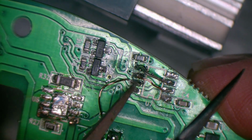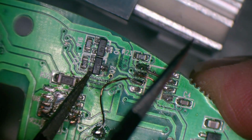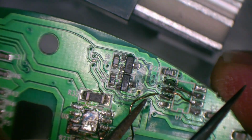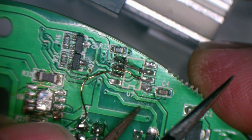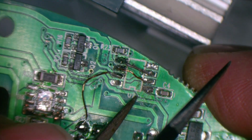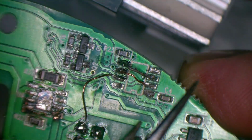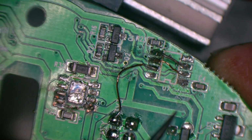I actually had it backwards, and I PWM'd the supply rail to that regulator, so I was getting a funny oscillation off the supply coil, but it still worked and always had the enable on. But now I've switched it back. That's what it should be now. But yeah, if you had any idea what sort of IC that might be, we could do maybe a proper fix. But in the meantime, that works.